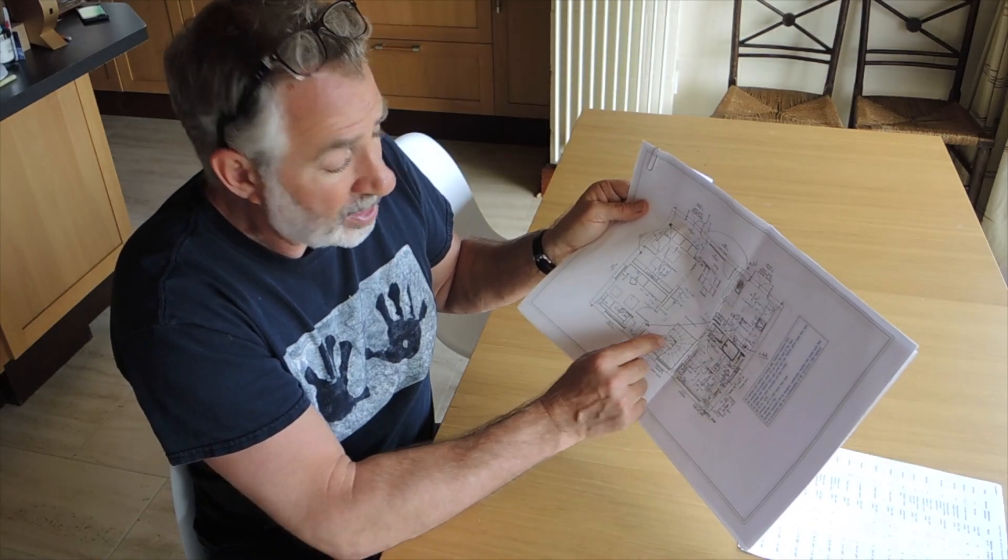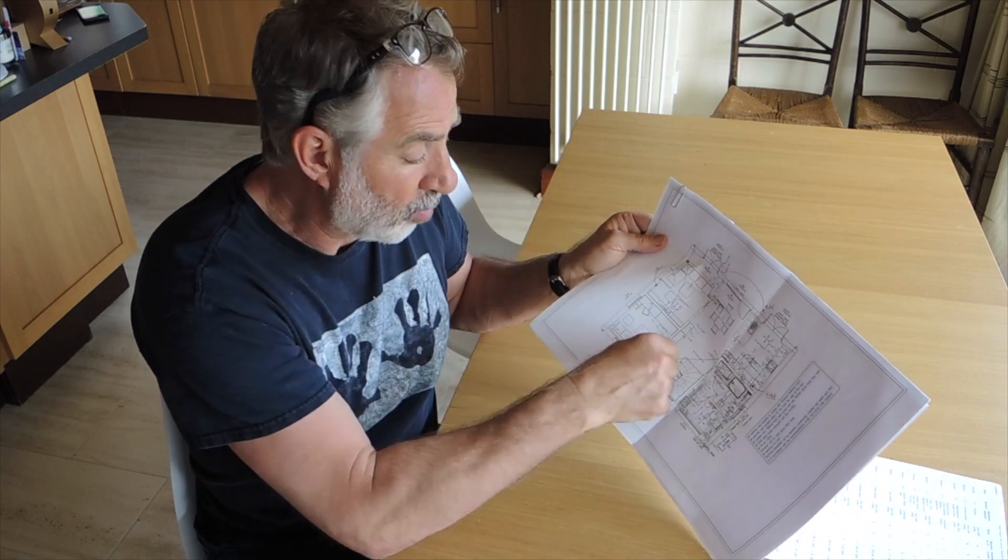Dan would only give you two outside lights — one on the front door and one at the back of the house. So if you want to add more outdoor lights, now is the time to think about where you want to put those. As far as ceiling lights go, they give you one light in each room and position it, which is basically in the centre of the room. Think about the light in the hallway on the stairwell — do you want the stairwell light coming straight down the stairwell or somewhere else? I'm going in tomorrow to sit down with my agents to go through all my final interior design choices, and during that process we also go through the electrical plan together to work out anything I'm moving, adding, or changing on the electrical plan.